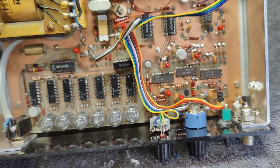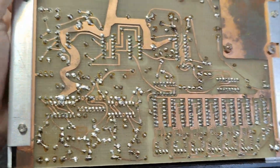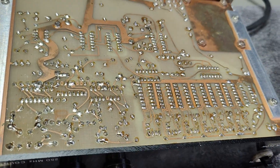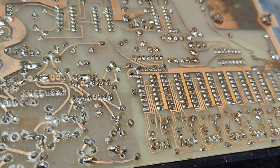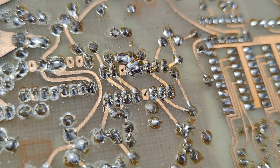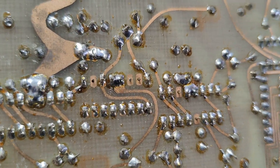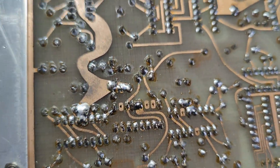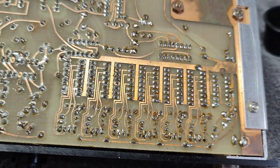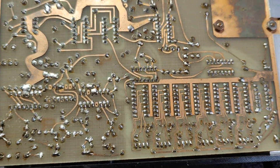It looks a little bit like a prototype or some homebrew, but if we look at the other side — it's a double-sided home-etched circuit board. So that means there's no vias, no connection from each side, so you have to solder all the pins. He even soldered only the pins you need — those pins with no connections, no need to solder. Definitely a circuit board made all by hand on a transparent film, and then you'd use those rubbing sheets. It's lovely.